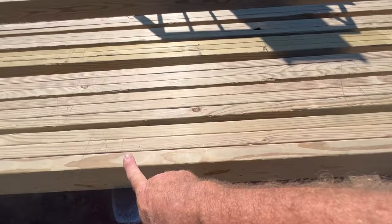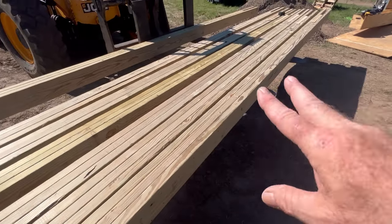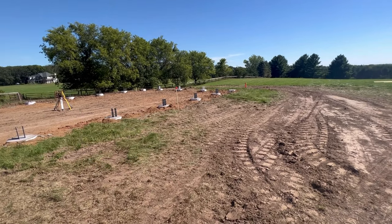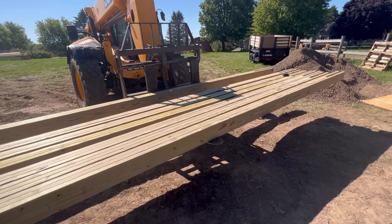Now I've got the top of my truss, my first two-by, and then every 34 and a half inches all the way down. I've got seven of these here and that covers this side of the building — these are all ready to go. I'll just go get the other side and do the same on the end walls.